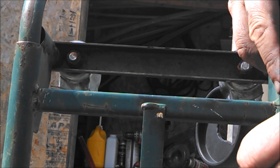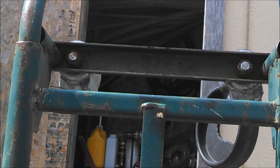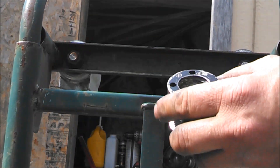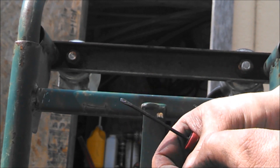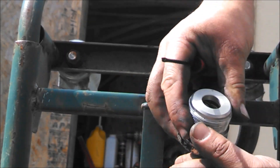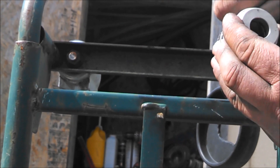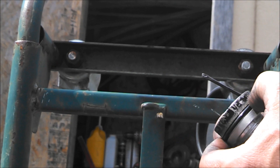Then you've got these two O-rings. There's a little bit of crud in here — get a rag, wipe it out, go to the inside groove. The big one goes around in that outer groove.